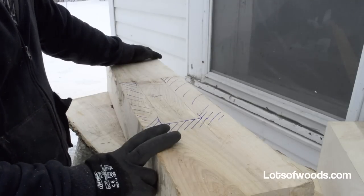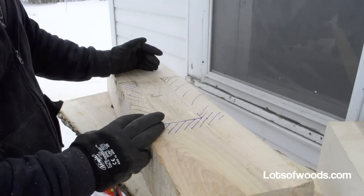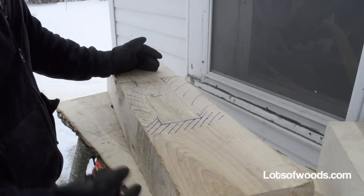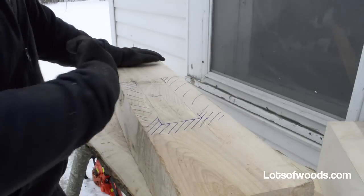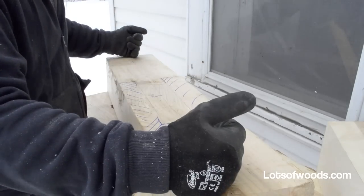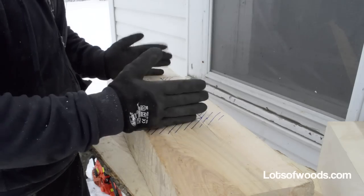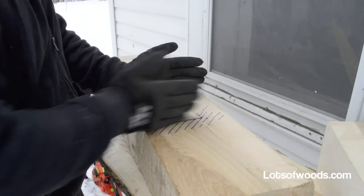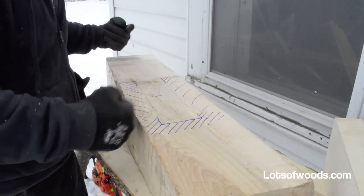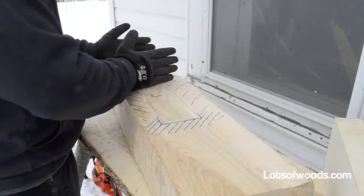What's important for milled timber is picturing a nice square piece of joinery inside an imperfect log. I know this cut is okay. This cut here, I was just standing on the log and cut, so it's off and it's bad. But we got our center down here. I know that these are parallel to each other, and so when it's on the bed of the bandsaw, I know it's going to make a 90 degree cut. So when I cut this out, I'm going to have something that goes in the mortise on the bed straight, and I want this pin, if I just drill it 90 degrees, to point straight. I don't want it to be off, and I don't want the poppet to be off either.